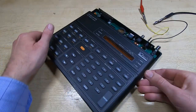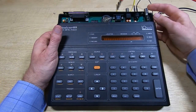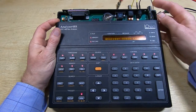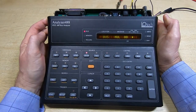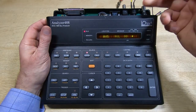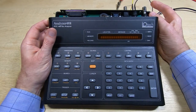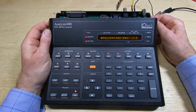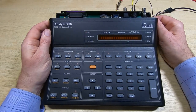I've made one up - this is effectively a DS-1210 replacement. I'll get this plugged in. So that's our DS-1210 replacement plugged in. We'll try powering this up and see if we've cured the problem. The first time we power this up we will get an NVRAM error because it contains nonsense from the previous time we powered it up when we didn't have a working controller. We'll now try to cycle the power, and this time it should go straight through and start up without the error - and it does. We'll try that a few times just to show it wasn't a fluke.